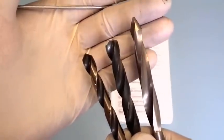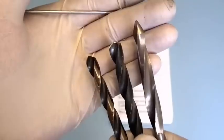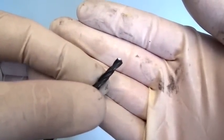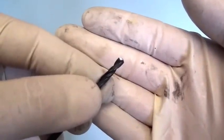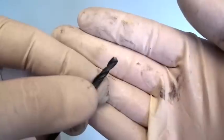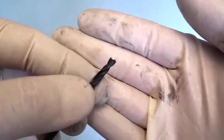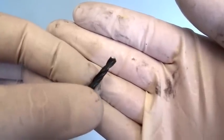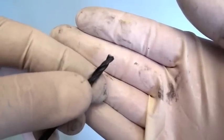So it's possible to do this filing off and backing off with a small drill. You just have to be very careful and use a little jeweler's file. Hopefully you can just see where I've backed this small new 4mm drill off just by lightly removing the very sharp angled front cutting edge. So this would give a far more controlled drill down say a 3mm hole into brass if I was going to enlarge it out to 4mm. This is what we'd do in the workshop to ensure that the hole's nice and clean and the tip of the drill doesn't jam and break off.